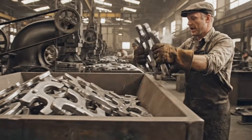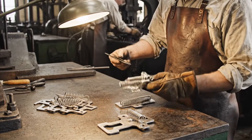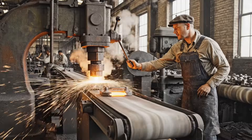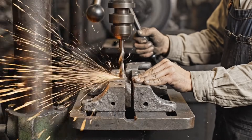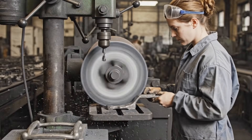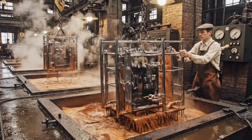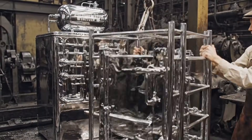Quality looks good on this batch. Observe the precision of the stamping work. These spring steel components are formed and blanked, creating the reliable door closure hardware of the age. Introduced the same year as the iconic Monitor Top in 1927, these handles begin as molten zinc before the precise work of the machine shop, depositing a bright chrome finish at 0.001 inch per hour — chrome emerging commercially the same year as the Monitor Top, 1927.